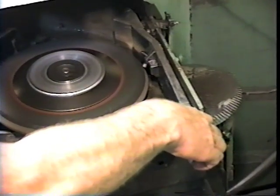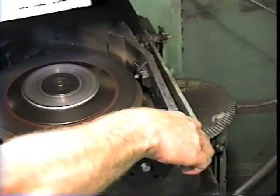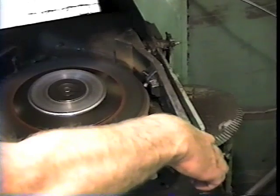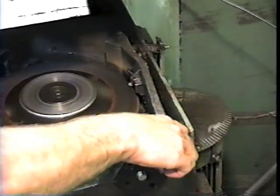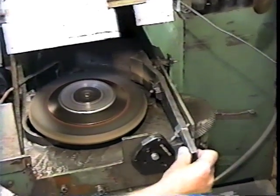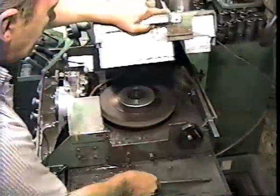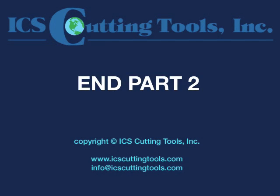This is something that you won't learn to do overnight, but after you've done this about ten times or so, you'll get the hang of it. Because if you move that stylus — I'm going to do it just one more time, a little lighter on the stone. Now I'm going a little faster. I am not tugging on that arm; I'm simply putting all my force on my thumb and drawing it up, keeping the arm out. Now I'm going to back that wheel out of the way so I don't accidentally knock out the diamond or damage the dress. I get my wheel back into its relative position, turn my wheel off, close my cover.